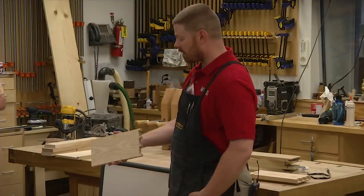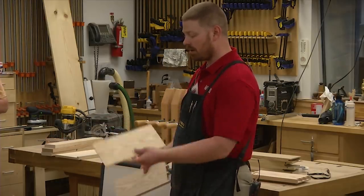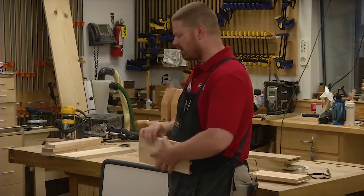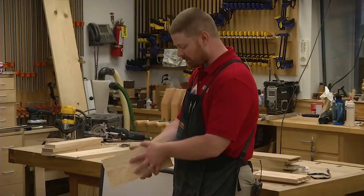With this method, another thing that you saw guys would do is, let's say I'm making it out of walnut, I'd use a plain Jane walnut board here, and then maybe this board would be burl or crotch figure walnut, glue that on the front, and then you go, well, how in the world did you cut dovetails on a piece of burl? It's just the actual veneer on the front.